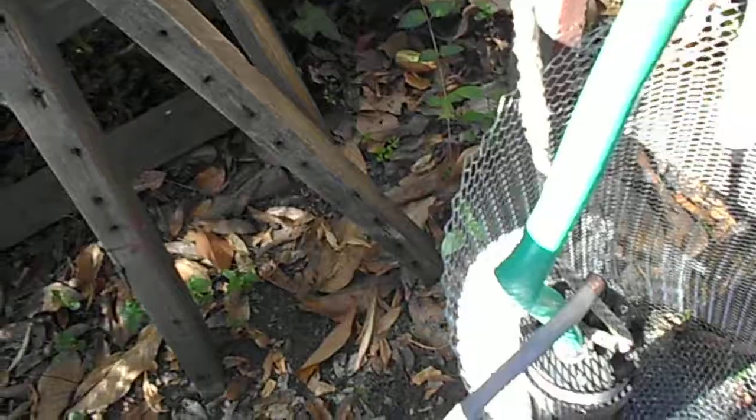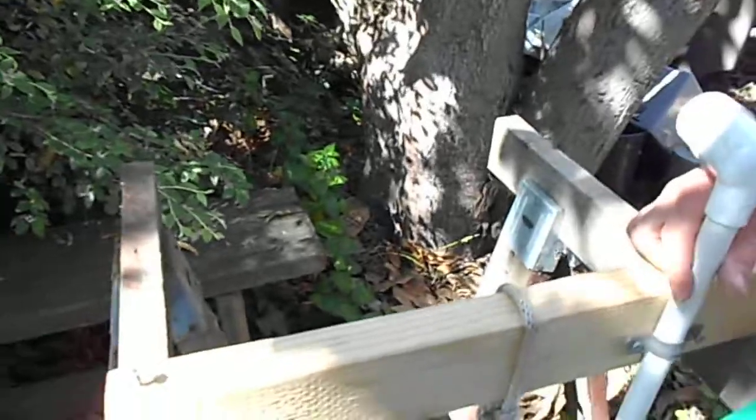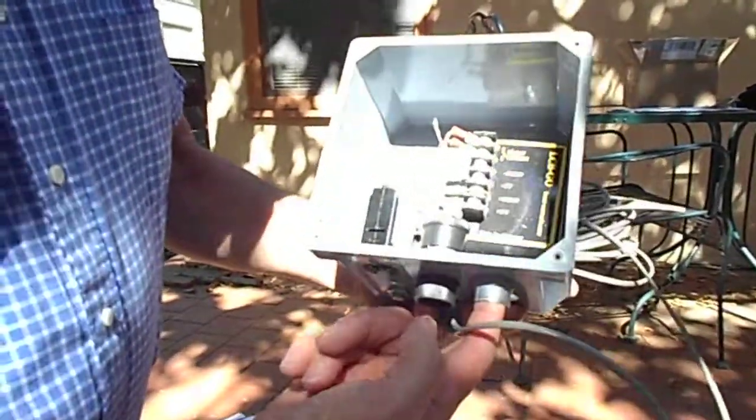You may or may not have enough water to pump all day to keep the pump from running dry. It doesn't hurt it to run dry, but if it starts sucking mud, that's not good. So there's a level switch — the float goes up when there's plenty of water; if there's not enough, it drops and turns the pump off. Here's the pump; the float switch is always up above a certain level. There's a wire that connects from the float switch to the controller. Only one controller is necessary per system — the wire from the pump comes into the controller here.